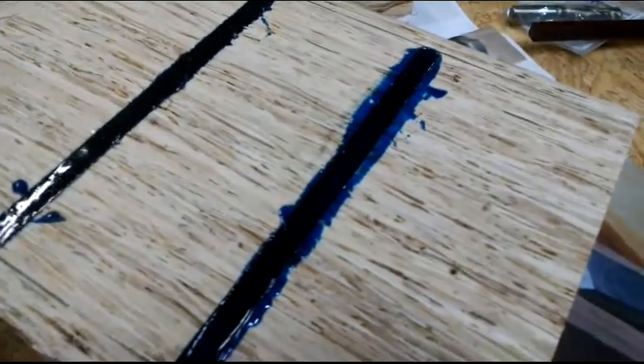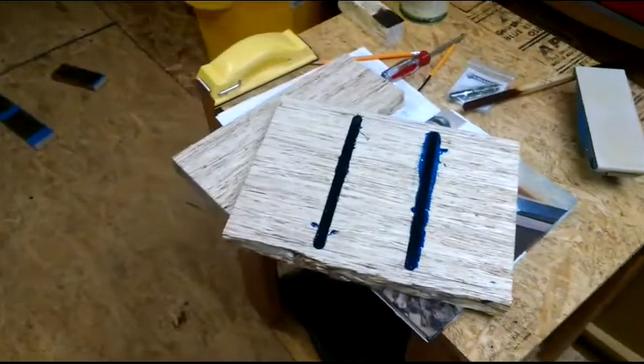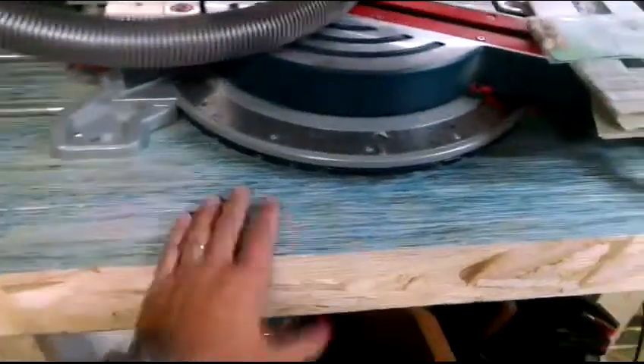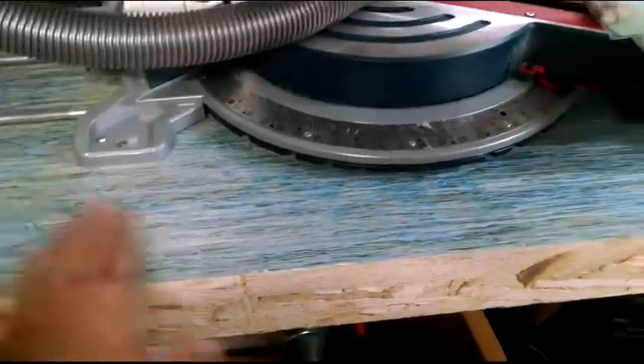For those asking why I dyed it blue — because I think the blue is damn pretty. And that is how I'm going to ultimately finish the chairs. The whole reason I'm making them out of timber strand, besides the fact that I kind of like this stuff, is that I think the way timber strand accepts dye — specifically blue dye — is just beautiful. It's much deeper and much prettier than you could imagine. The lighting here is rather poor, but you see that wash coat. This is timber strand with a half-pound shellac on it, and then blue-dyed shellac over that — a very thin wash coat. What I have down here is blue-dyed shellac — a half-pound cut of shellac with blue trans tint — applied right to it. And if the lighting were better, you'd see how deep and rich the grain becomes.